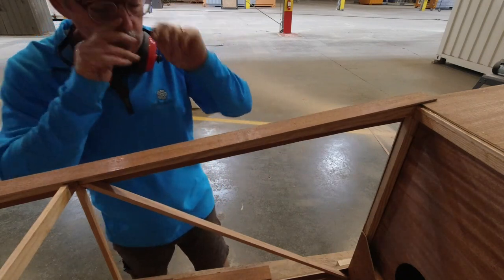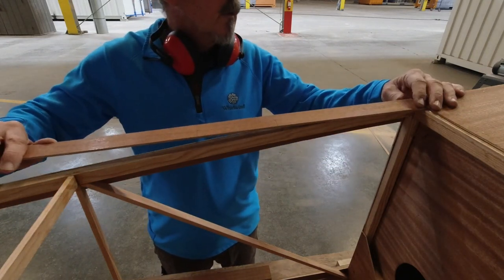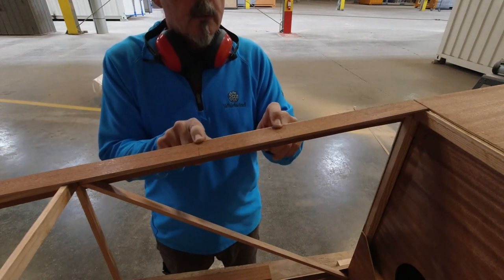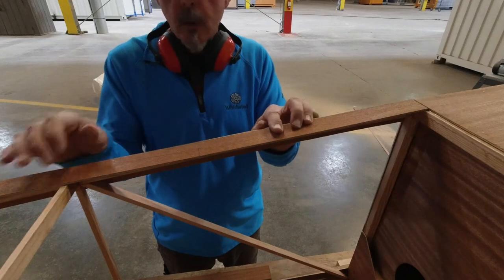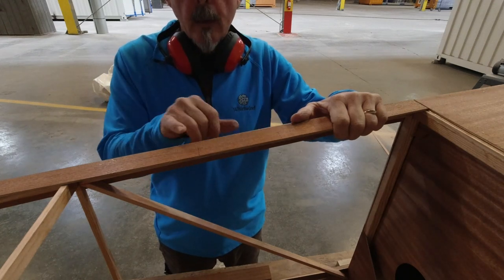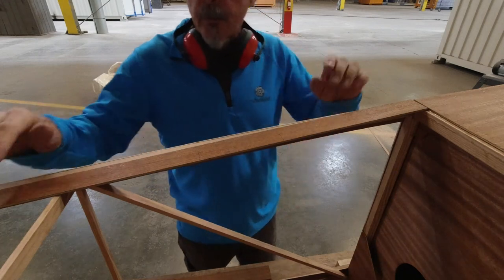The next thing is to get the inch-and-a-half pieces on. Because we curve from here to station five, in order to get this piece to curve, you actually have to make a couple of relief cuts in it. I'll do that with the bandsaw — that'll relieve it enough for it to flex in. I picked a couple of middle points at about halfway between the two stations. I drew a three-quarter-inch section that I don't want to cut into since it fits flush against the outside. I'll make those two cuts and we'll see how well it curves.